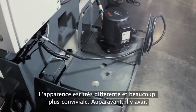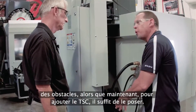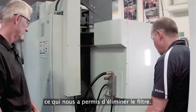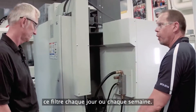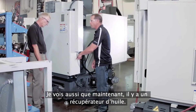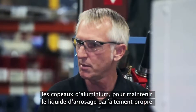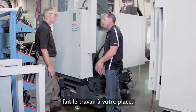This looks a lot more user-friendly because where you used to have some interferences, now when you do add TSC, you drop it straight down — you don't have any sheet metal in your way, nothing to worry about. We also changed how the coolant flows, how we port the coolant, and that allows us to get rid of the filter. That's a big deal because now you've got one less person in the shop having to come back and check that filter daily or weekly — one less thing to do, one less part. We also have an oil skimmer now, which we didn't used to be able to add to the Mini-Mill. As the coolant breaks down you get that scum layer and some floaty aluminum chips, and it does a great job at keeping the coolant clean. No shop personnel have to mess with the coolant — this thing just turns on and does the job for you.